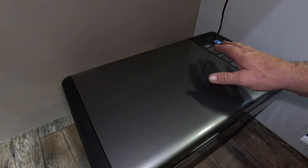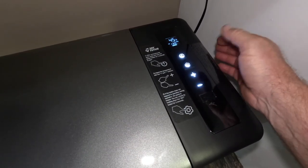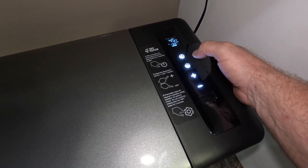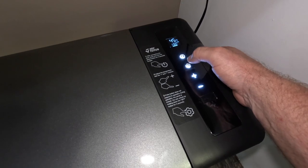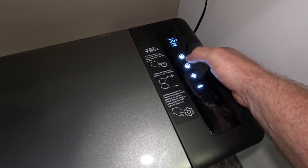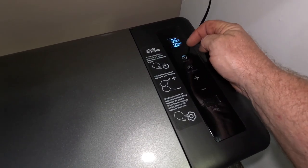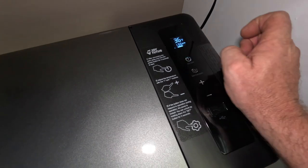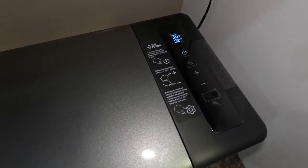We don't want to get it too cold because our drinks will freeze. We'll make an adjustment and take it to 45 degrees. Then we'll lock it at that. We got it on ECO mode now — that's how you set ECO — and that little display window gives you all your information. We're going to let it warm up a little and see if we can get it back up to about 41 degrees with the set point at 45.